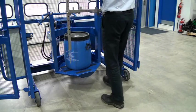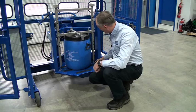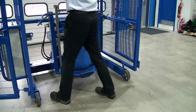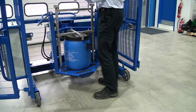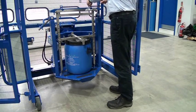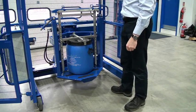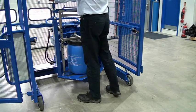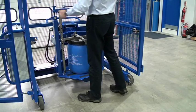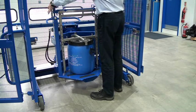We lift the adapter in and place it on the base. The two bars go down through the holes at either side — adjust it so the bracket definitely sits down on top of the drum. Then we have our lifting beam and the clamp down beam, which sits on top of the bracket. Bring our clamp screws up, just tighten down loosely on top, then bring the second one over and spin it down. Do the same as with the 200 litre drum — half a turn at a time until nice and secure.